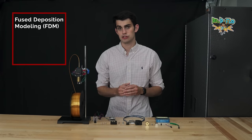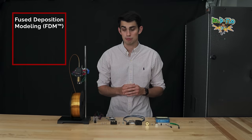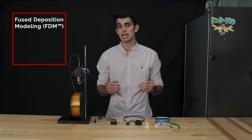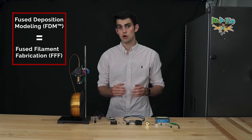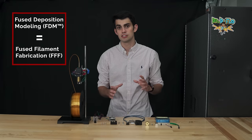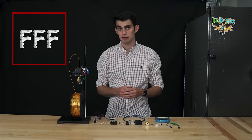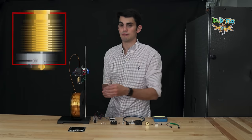Just a quick clarification, the term FDM is trademarked by Stratasys, a large 3D printing company. Due to its trademark, the DIY 3D printer community has rebranded FDM as FFF, or fused filament fabrication. There's no difference between the terms besides the trademark. Looking back, I should have exclusively used the term FFF for this video because I'm appealing to the maker community. But anyways, let's get back on topic by going over the anatomy of an extruder.